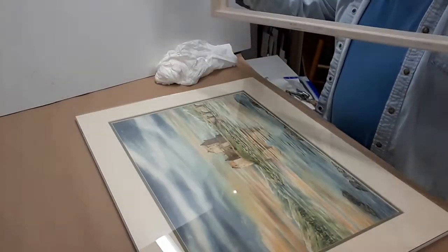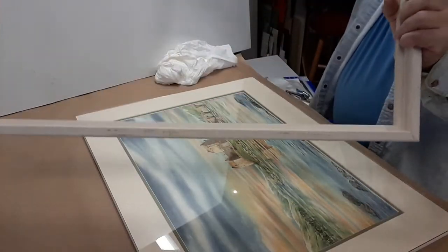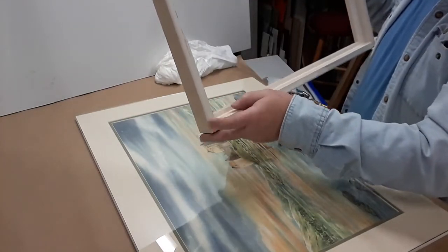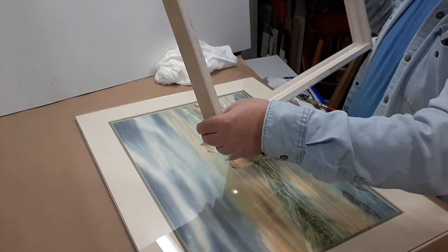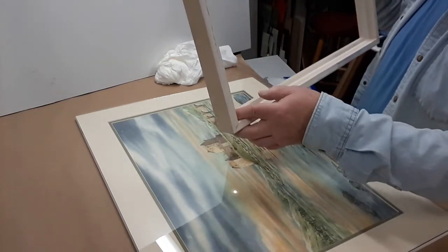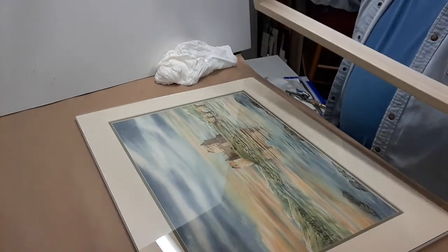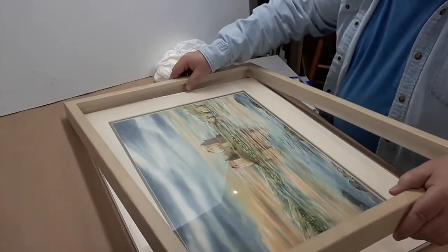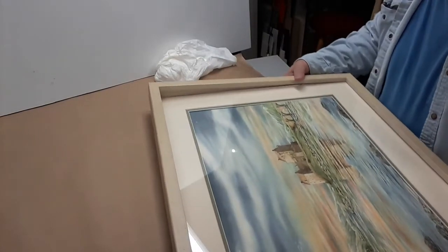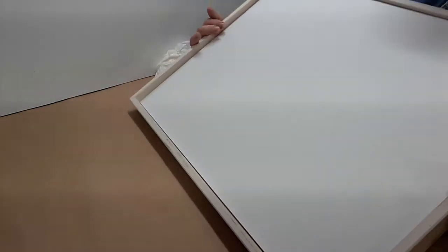You want to make sure that's all done before you put it in the frame. This looks really good now, so I'll go ahead and install it. Another thing to remember is when you've glued the frame together, a lot of times there's a little bulge of glue underneath, and you need to take a razor blade and take that glue out of the corner so the glass can lay nice and flat into the frame. Then it's just a matter of laying the frame on the piece and pushing it up to the underside of the lip of the frame and turning it upside down.